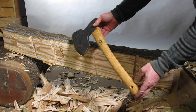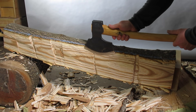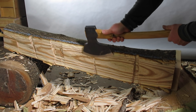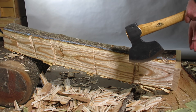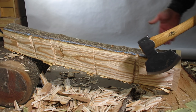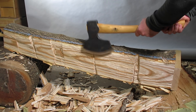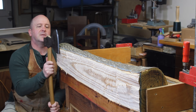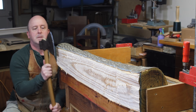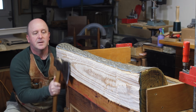When I have a left bevel axe — with a flat back on the right and a bevel on the left — that axe is going to be traveling along the left face of the log viewed from above. Notice how the log is oriented just the same as before, but the axe's orientation to it is different because we've turned around. Ergonomically and safety-wise, it can even be good to have the work up high so that you can really pay close attention to where the flat plane is.